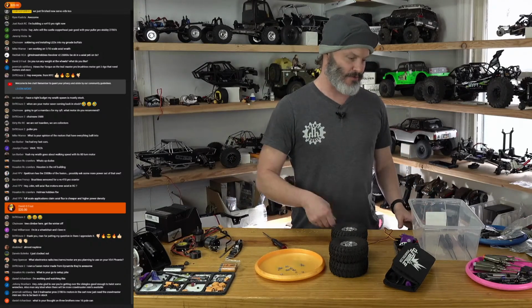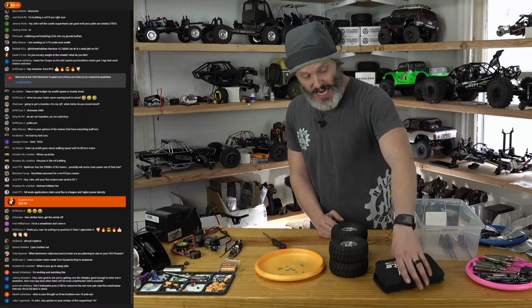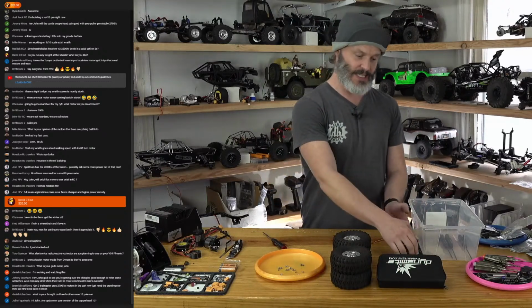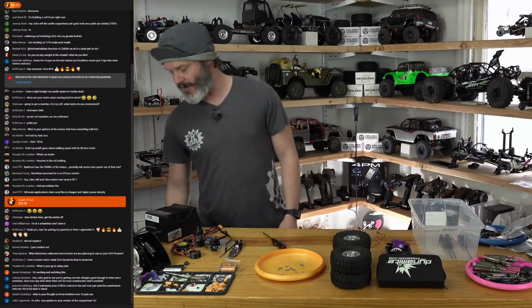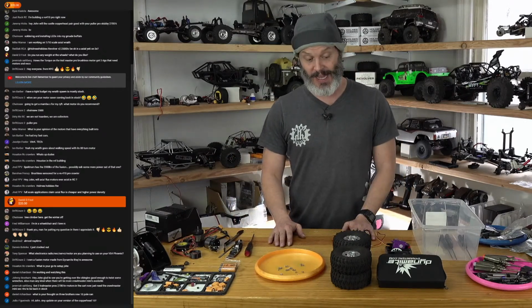For a printed coil, you have to have a lot of turns, and the trace width is just not very conducive to the high amp draws that a torque dense motor usually needs, unless you do really low kV. And if you do low kV, then you have to use a high voltage to try to get your torque out of it. And a coil is still going to be a coil at the end of the day, though. So yeah, I don't think so.